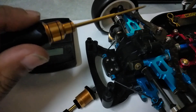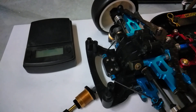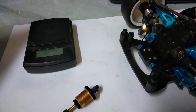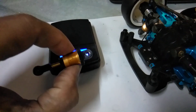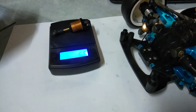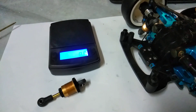The problem is the damping — I couldn't figure out how to do damping. So I initially put on the standard dampers, but they are a little heavy. This one, the Schumacher short shocks, is 6.6 grams — and that is already without the retainers. So 6.6 grams, not so bad.